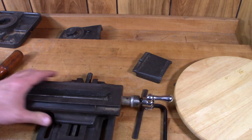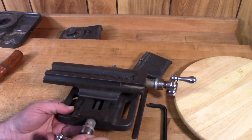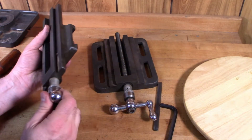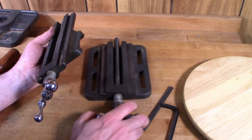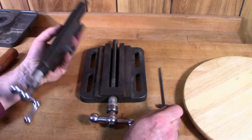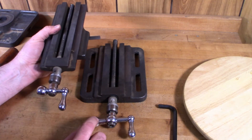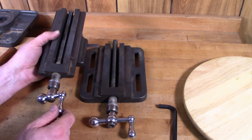To get the top table off it's kind of the same thing — just turning this one, and this one's even stiffer. I removed the carriage slide off camera just because it was taking a long time to crank it all the way to the end, but it just slides off like the first one did, and there's a gib there too. Next step will be to remove these crank handles — they're held on just with a nut so I'll grab a wrench and remove those.